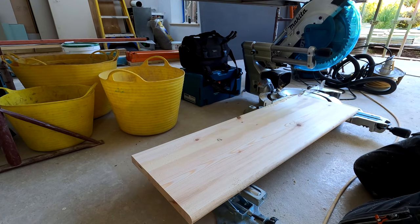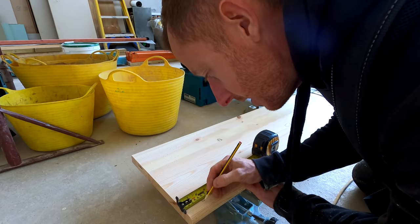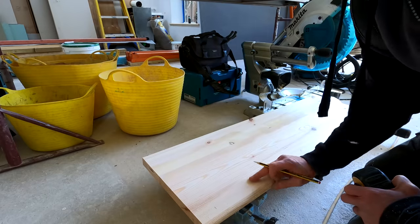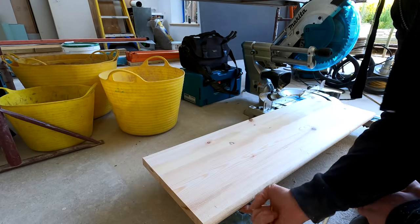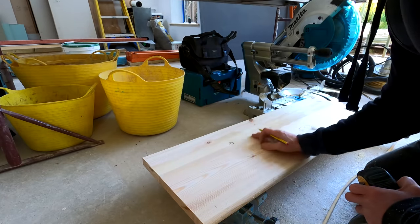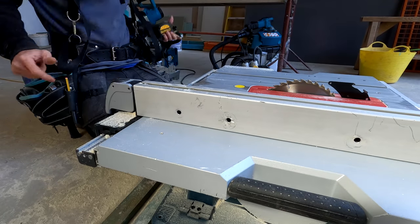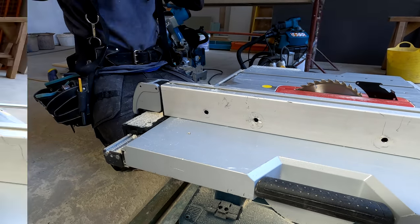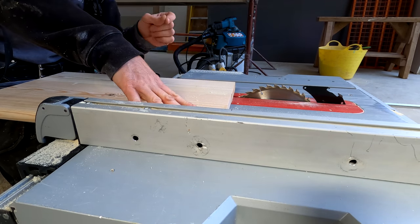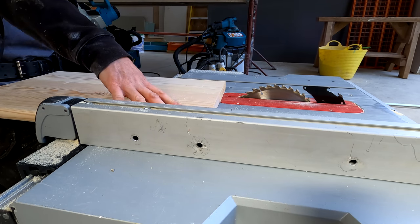I've got that cut and I know I need 50mm either side for my nosings, so I'm going to cut 50mm back here and 50mm back on this side. Before I get this trimmed out I've got to do the overall depth of the windowsill — I know that I need 265mm, and that gives me a 30mm overhang past the plasterboard. I'm just going to get the table saw set up now, get this trimmed down, and then we can look at getting these horns sorted. Get an off cut sat in here and get it trimmed off so you know you're in the right place.